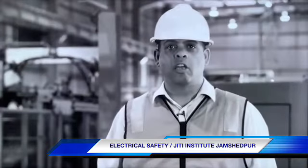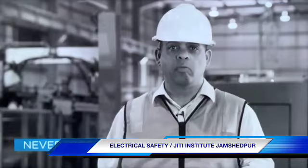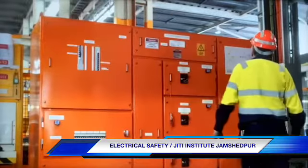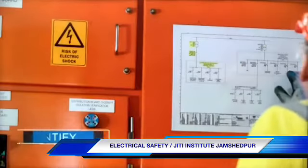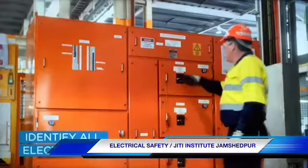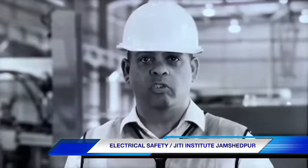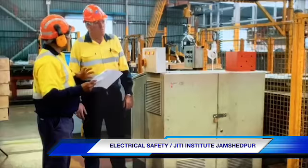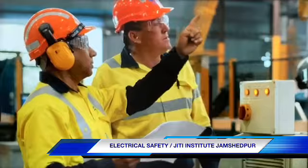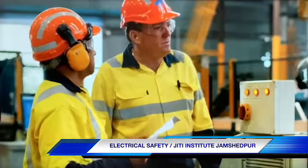Plan ahead so that you never work blind, and ensure your workers are qualified and experienced. Before starting any work, make sure you identify all electrical sources. Remember, not all electrical installations are the same. Then, once you've identified the sources, assess the risks associated with the work and plan accordingly. Also consider the possibility of any conductors becoming energised during the activity.